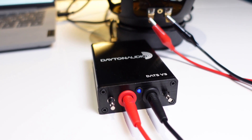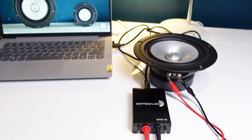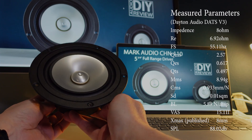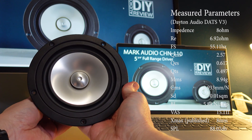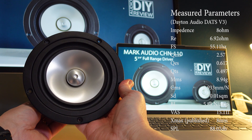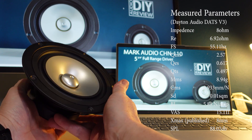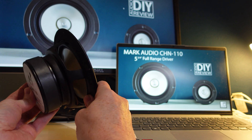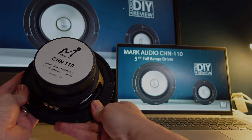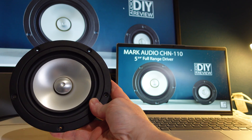I've decided, as well as a sound test, I'm going to take some readings with the Dayton Audio DATS V3 to see how they compare with the published parameters. The readings achieved did vary in some aspects from those published, but obviously my room at home won't compare to the test facilities used at the Mark Audio factory. Take these as you will — they may help with your build. You may want to use the published parameters, or you may even want to carry out your own. I did find that the readings such as the sensitivity were absolutely spot on.